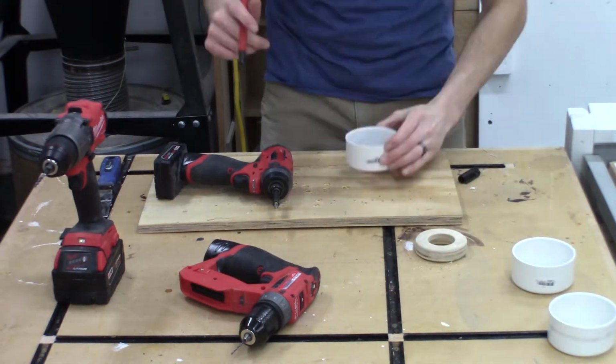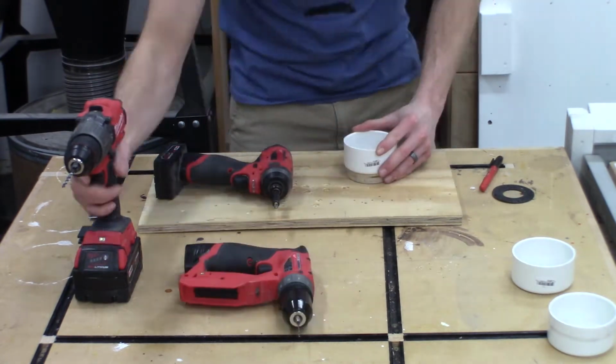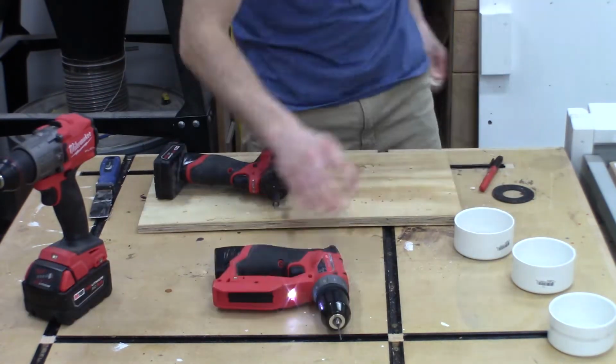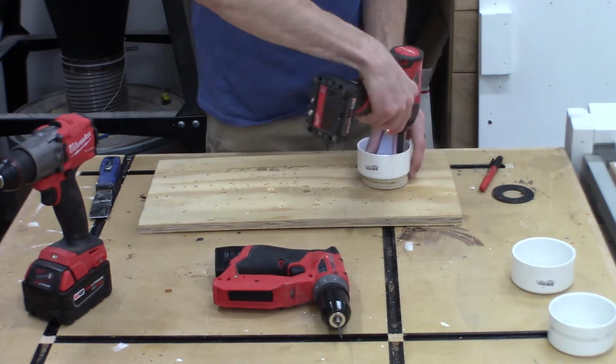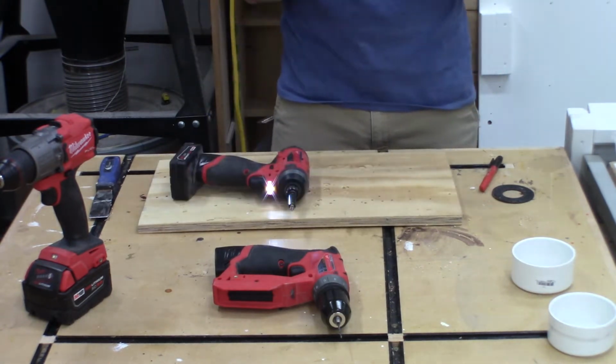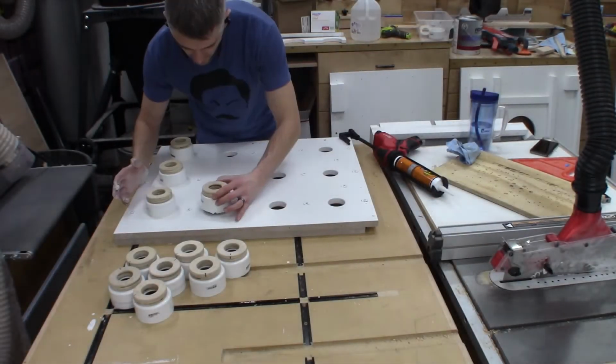After creating all 12 of the scupper valves or check valves, I marked what I'll call the hinge location of that valve, which is where the flap is at, and I want them all pointing up, so when it's in its assembled position, gravity will help close that valve down.